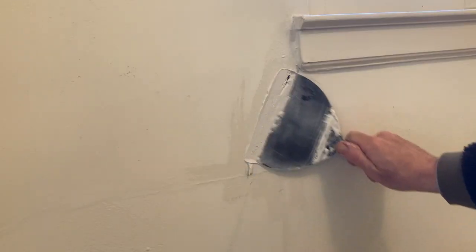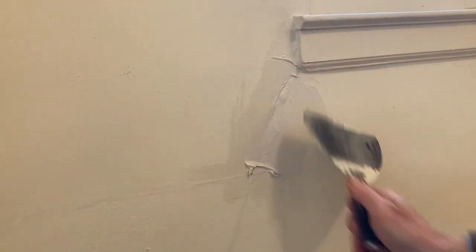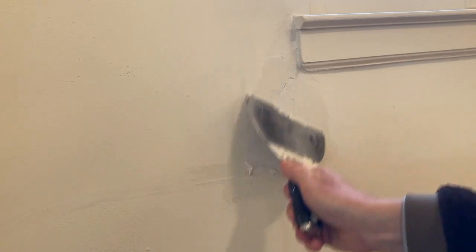So that's okay. Cruise around, look at this. There's this big old gap, right? So you can fill that. Work it both directions to make it easier to tape. Come back and tape that. I guess up here, same thing. Still got some mud in the pan. Same thing here. Put some bonding adhesive on there and just fill it. Not going to show you that.